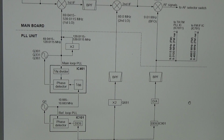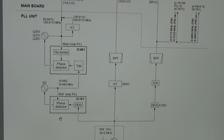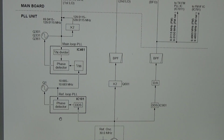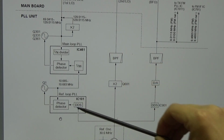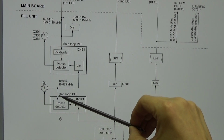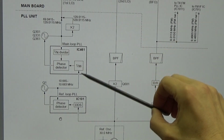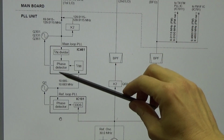Therefore we need to know about the theory behind these dividers and how it all works together. Today we just want to look for a practical way to check if these circuits are working or not, and therefore it is important to know that we always have finally a reference frequency and a feedback frequency, and both need to be the same. So simply forget the divider in between, so that would be another story.